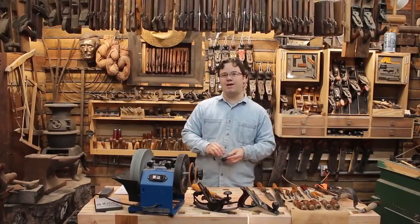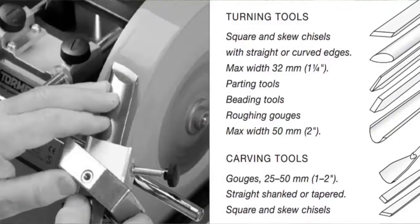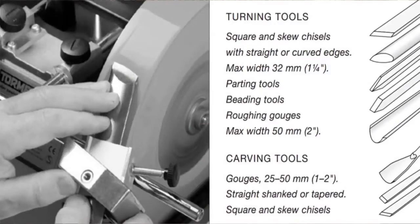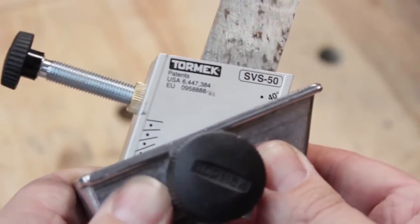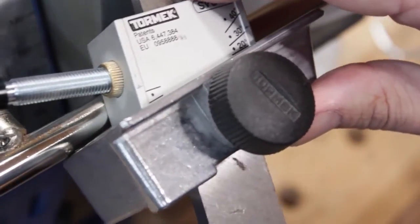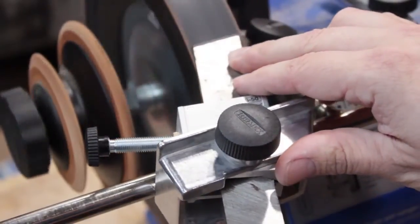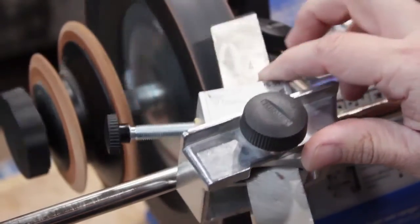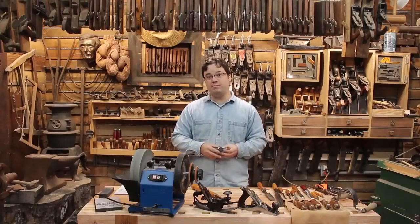This little bit of genius does the hardest sharpening jobs with more accuracy and repeatability than anything I've ever seen. It's for those tools that just don't work very well with other jigs — skew chisels with straight or curved edges, parting and beading tools with narrow edges, roughing and carving gouges too wide for other jigs. Three settings allow you to customize the jig to the tool, and once you dial it in, you can record those settings so every time you go back to re-sharpen it, you're perfectly duplicating the edge. Multi-jig? I suppose that's a good name, but I think 'difficult to sharpen tools with no fussing or cussing jig' would be far better. It's one of those jigs I reach for when I'm already in a bad mood, because I know I have to sharpen a tool that I dread. But by the time I'm done, I always walk away feeling like a sharpening master. I like to think it's my skills, but it's really the jig.